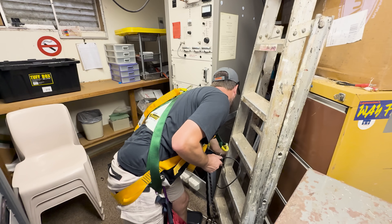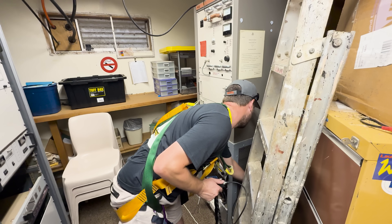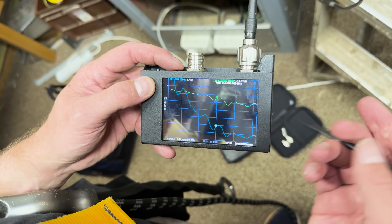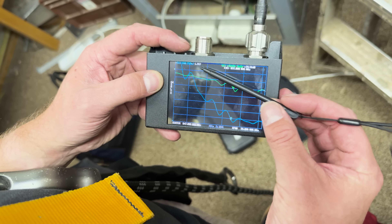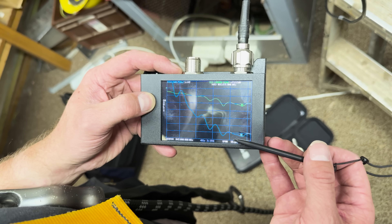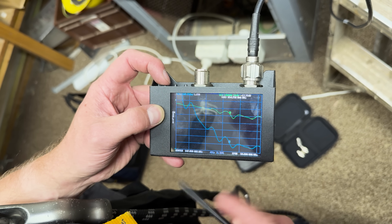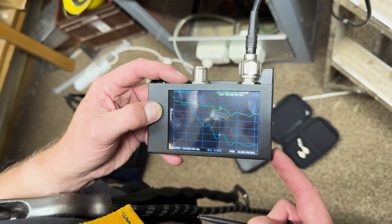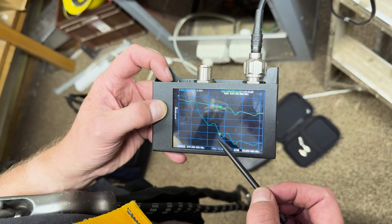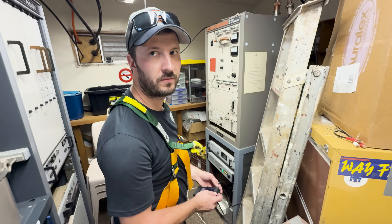Let's do a sweep. So this is what it looks like — it's not perfect, there are a couple of little wavy bits. As we move the marker along the frequency moves along. At 847 MHz — our STL frequency — it dips down to about 1.1 at 856 MHz and about 1.1 at 867 MHz. The center is 847 MHz, and it almost sits in a dip but it's a little bit higher — 1.4 SWR, which is fine, and certainly better than what it was.